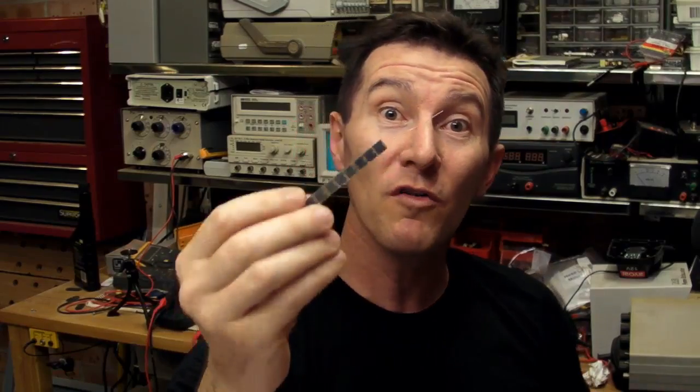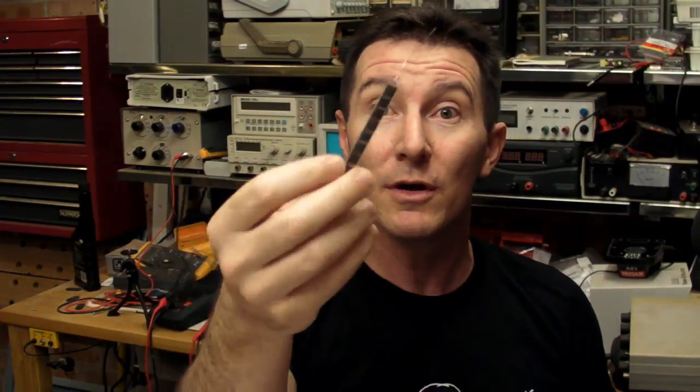They give out 12 milliamps at their rated voltage of about one and a half volts, so they really are quite remarkable. You could charge a mobile phone in full sun with one of these little things easily. So why doesn't it work inside? The answer's really obvious with a couple of seconds' thought — it's about dynamic range. The human eye has a massive dynamic range, about 90 dB or something like that. That's why you can go outside on a fully sunlit day and see things perfectly, walk inside and your eyes adjust, and even go outside at night under moonlight and see things.